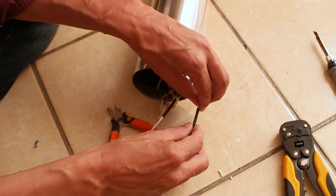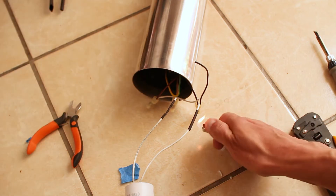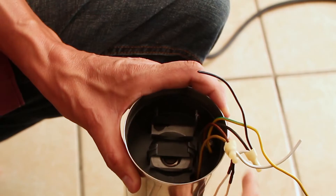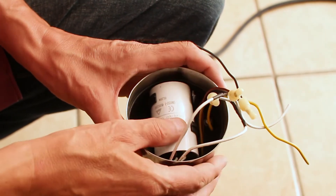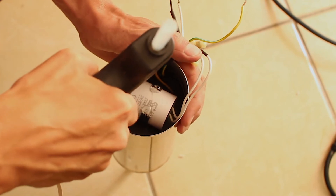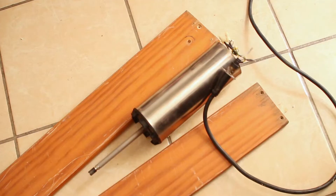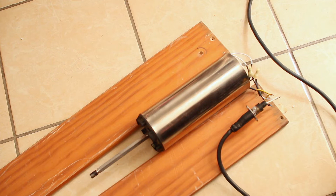These joints are then insulated using heat shrink tubing. Place the capacitor back in its clamp. I used hot glue to stop the capacitor from moving, but you could also use acrylic or silicon sealant. I reattached the pump wiring temporarily to see if the motor would start. Only turn on the electricity for a second when doing this, as you shouldn't run a dry pump.